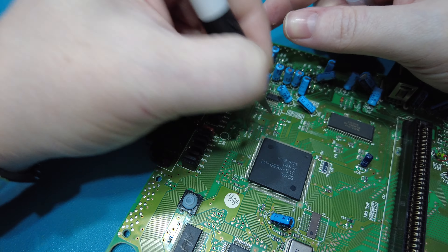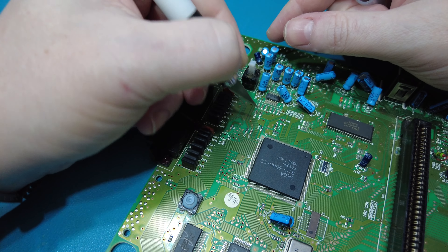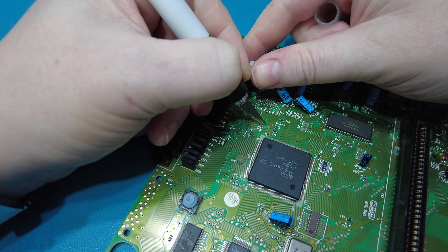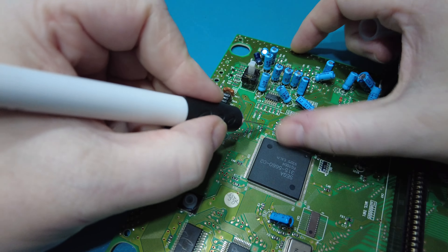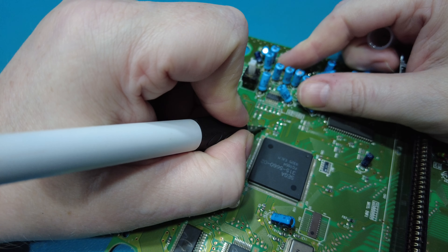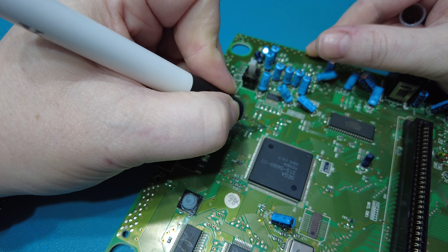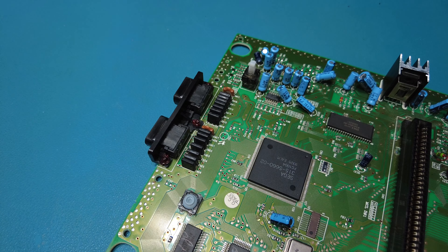I'm not doing this with the knife pressing hard — I'm basically pushing with my thumb, pushing down with this hand. That way when you do it, you don't slip. I'll just come along and do that again just to make sure. The blade just snapped — doesn't matter, it's still sharp enough. The good thing about these craft knife blades is if the end comes off, you've still got the rest of the blade. What I'm doing now is just digging the rest of the track out that I've cut away — just flicking it like that. And there we go, that's that trace cut as well. So that's all our traces cut.